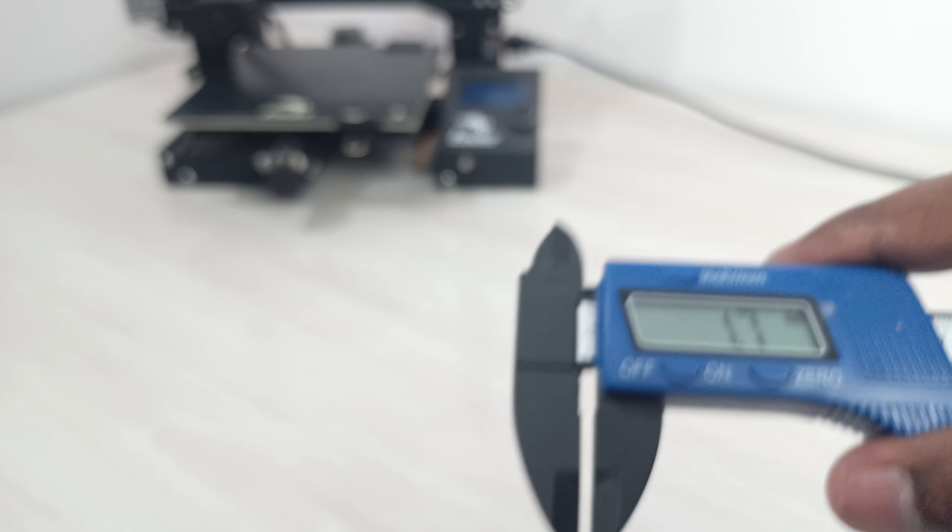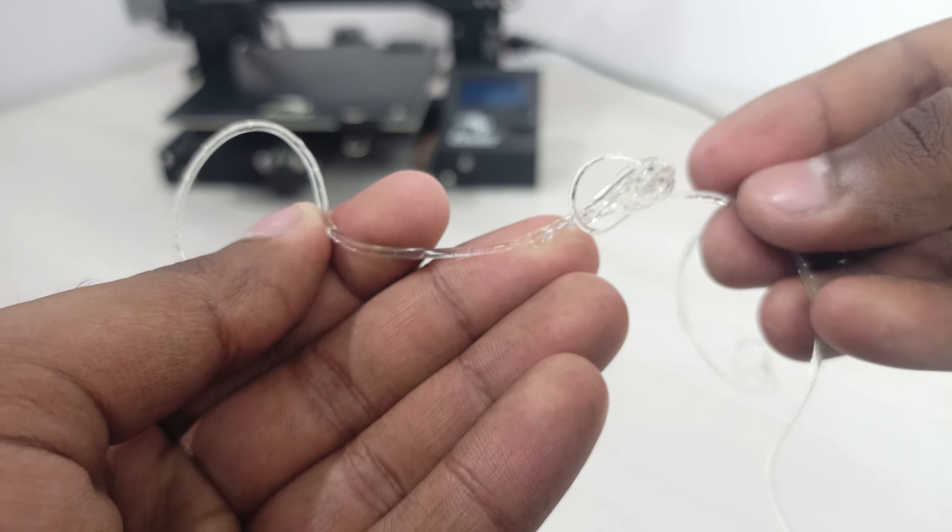It's still not close to industrial grade, and I don't think it will reach that level without very high-quality, expensive machines. But after playing with the machine for about half an hour, I produced a decent batch. There's a little bit of dust inside so I need to add a filter, but there are no bubbles in the filament, which is a good sign. I'll continue tuning to find the optimal RPM settings.